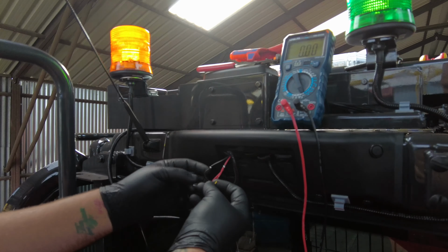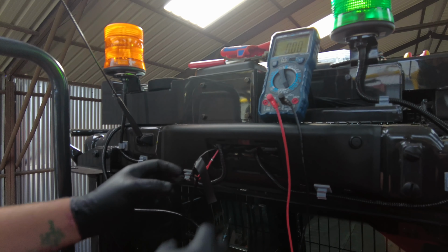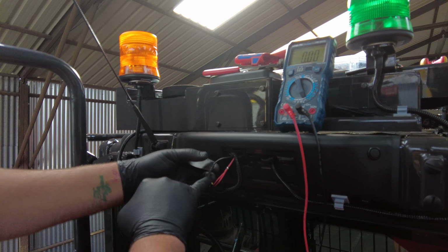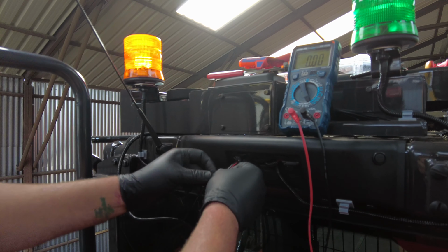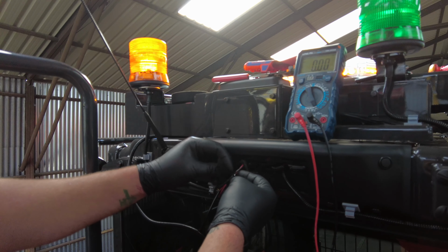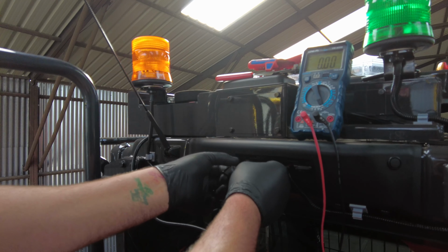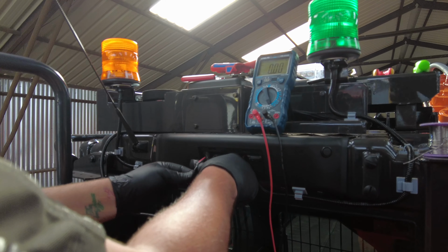So now all we've got left is the switch pattern onto the negative wire. Just press it on for a second and it will change the pattern. So with the pattern select wire, I've just chopped it, put it down there and taped it in where I've taped in the negative wire. Then what I do with the wiring is I just put it together like that and then tape it in again. What I'll do though, I'll try and put the tape through there. So then we've got the live wire covered and we can just tie it in with the negative wire.